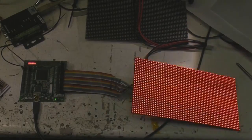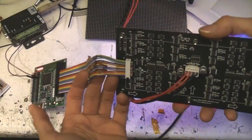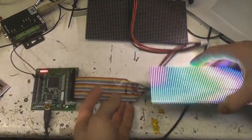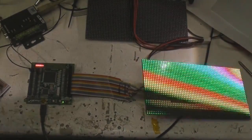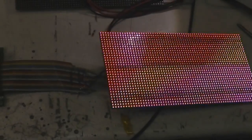So this little lattice board actually makes quite a nice little setup for driving these. It's literally just ribbon cable straight into the panels with some pinout juggling, and I'm just feeding this with serial data from the PC, and all that's sending is that 80 byte plus the block of RGB data formatted as per an uncompressed AVI file.